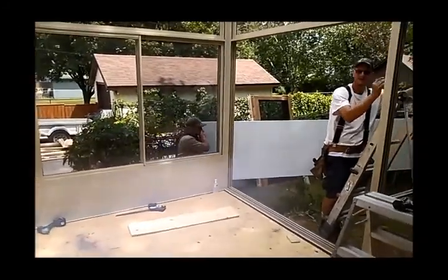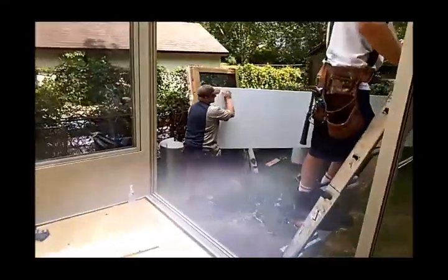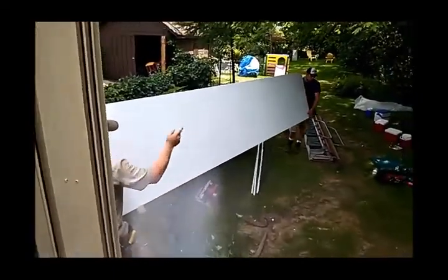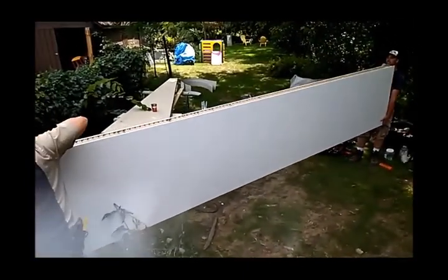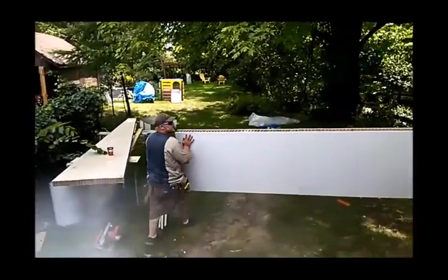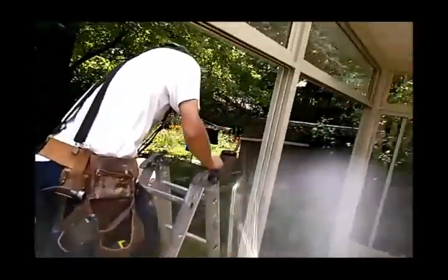Here comes the big 4.5 inch panel. The strongest, toughest top of the panel piece goes against the head. If you look here, see how these go one way? The crystal coat finish, if you're going against it, they get caught. So there's a grain, I don't know if you can see on the video, there's a grain on that honeycomb core, and so we're orienting the grain pointing towards the home so that it's easier when we slide in our cleats.